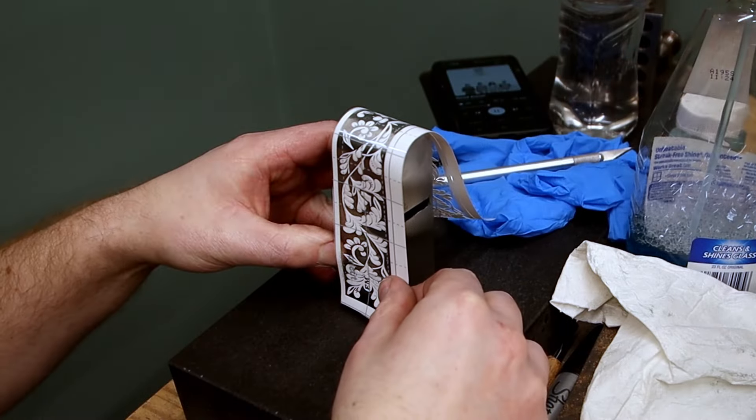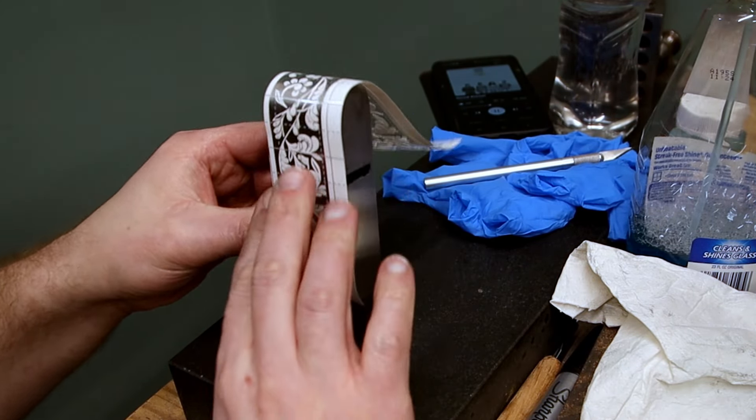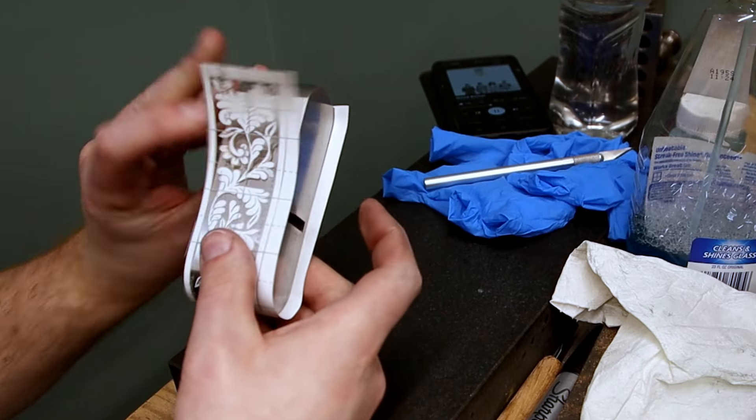You also need a mask. I use the vinyl cutter to make my mask. If you don't have a vinyl cutter you can also use electrical tape and just cut out your design with an Xacto knife. Alternatively you could also use nail polish and paint your design on there. Anything that's not covered by the mask is gonna be eaten away during the etching process.